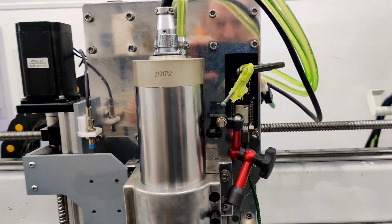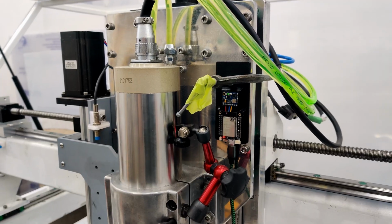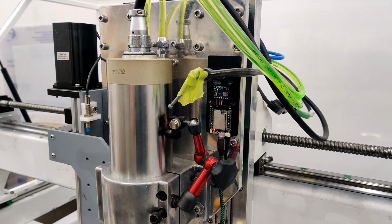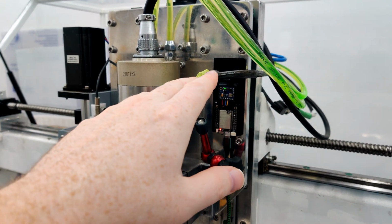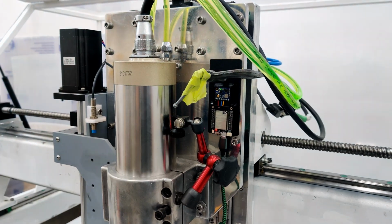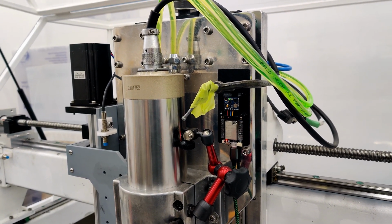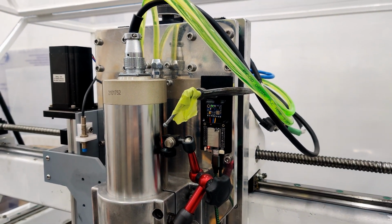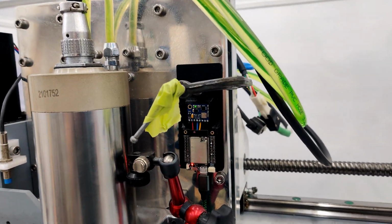So it is another day, and I ran some tests with the data coming off of this, and I've been getting some promising results. What I'm going to do now to improve the data is rotate the sensor 45 degrees. The MPU 6050's accelerometer is picking up gravity, which is 9.8 going down, so I'm getting a lot more resolution on that axis, whereas the other two, which are just free floating, are not picking up a lot of good data. So I'm going to rotate this thing 45 degrees, and that'll get me two axes. Right now, let me see if I can poke at something so I can show what the chip is.